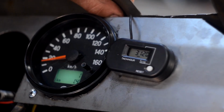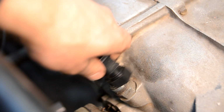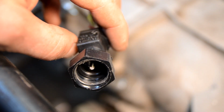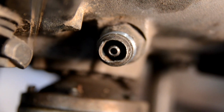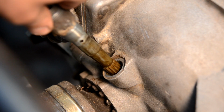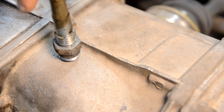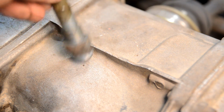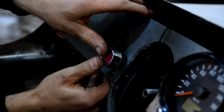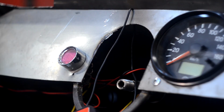During the test, the arrow of the speedometer fell and stopped showing the speed. I removed the velocity sensor and found out that the rod had broken off and remained in the speedometer drive. Most likely the coaxiality of the sensor rod and the opening in the speedometer drive got broken. I solved the problem by replacing the velocity sensor with a new one. I installed one more velocity sensor which I already had. It will duplicate the speed indication of the speedometer.